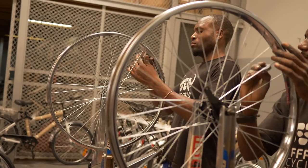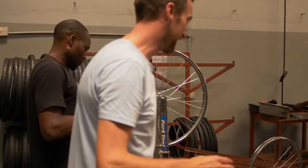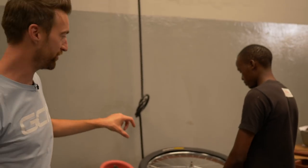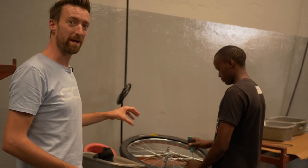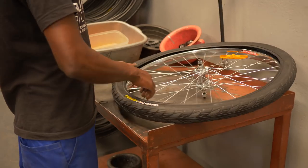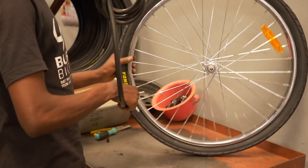There's quite a lot of quality control that goes into each stage of the process. Penultimately, we head over to where George is. George is in charge of putting the tyre, the inner tube, and the wheel reflectors on — all very important parts. The tyre needs to be at exactly 60 psi, which they have found to be the most durable. They are special tyres with a slightly different compound, which allows them to last a year or two as opposed to around three months that you would get with rigorous use with a normal compound. He makes sure the tyre is correctly seated and completely ready for use.